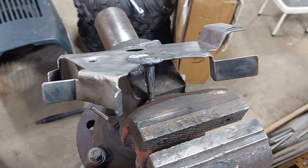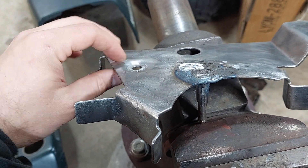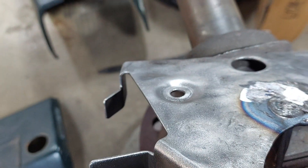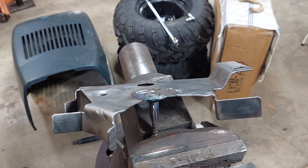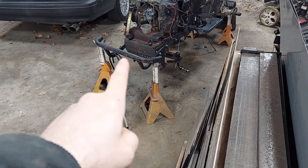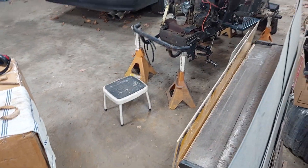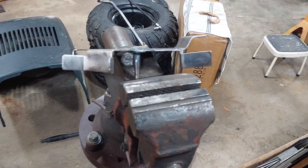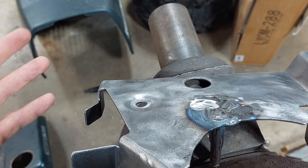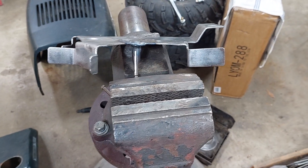According to the parts breakdown, there's a bushing that goes here — it's recessed, dips down — and then it goes up to the frame plate. It connects the two frame rails and allows the rear of the engine to sit on it. It didn't have one of the two bolts in it, and the bushing is gone. I'll have to figure that out — should be easy. It's a steel bushing; I might just stack washers or find one at the hardware store since they sell bronze and steel bushings.